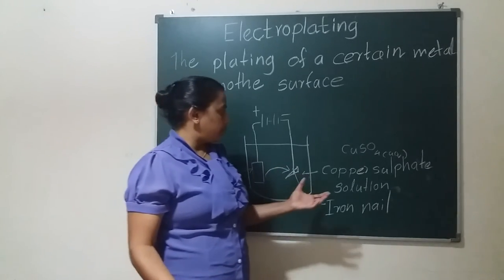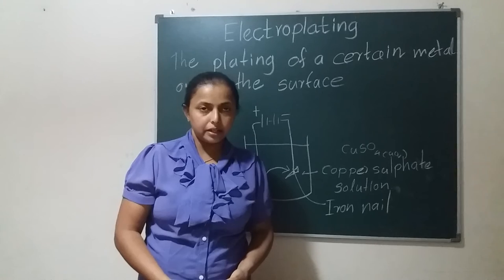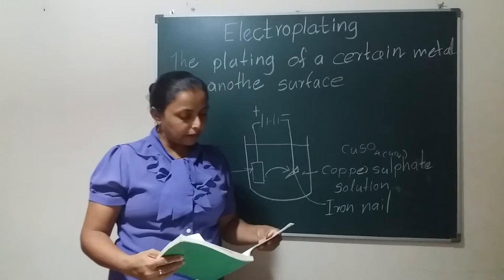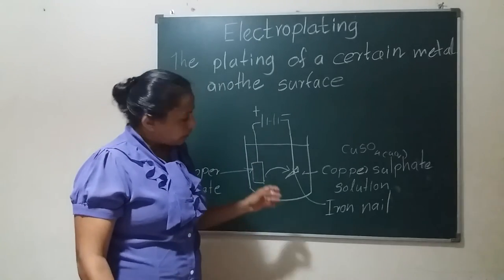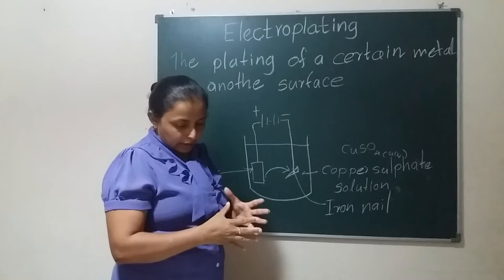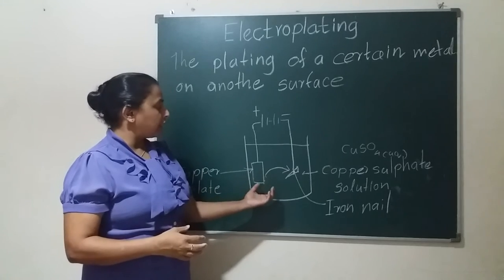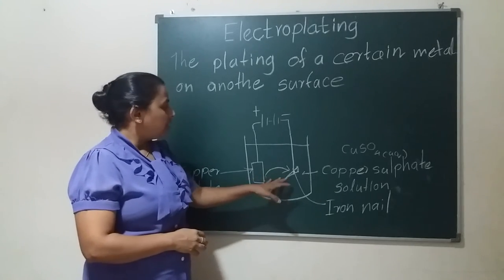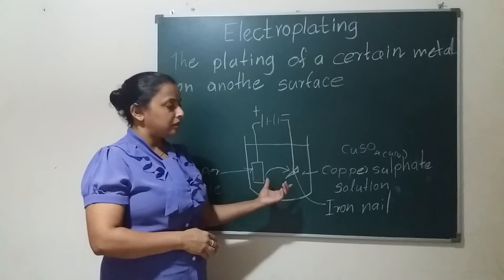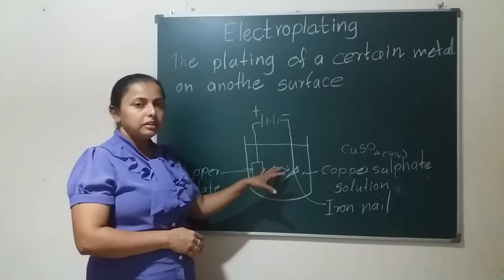Then how do we achieve this high quality electroplating? There are two things. First, the chemical changes should take place very slowly, right? How can the chemical changes be made slow? The electrolyte should be dilute. In dilute solution, the chemical changes are very slow.